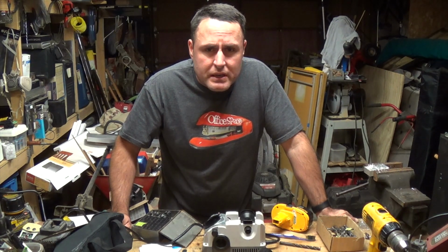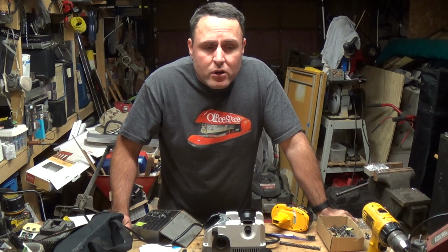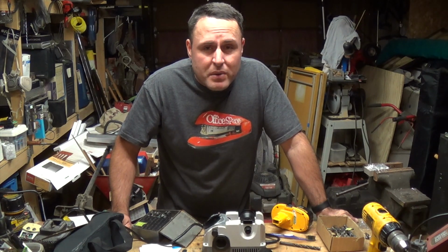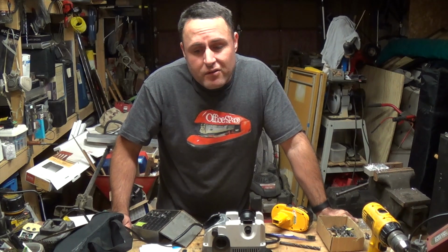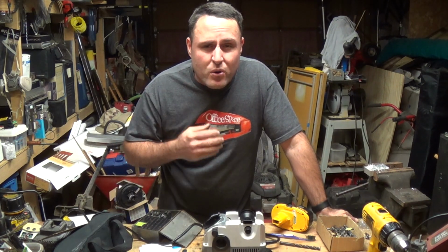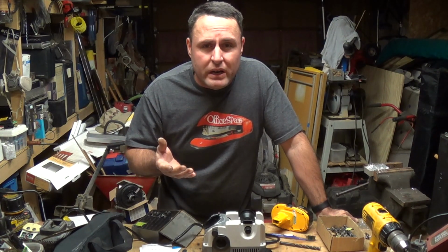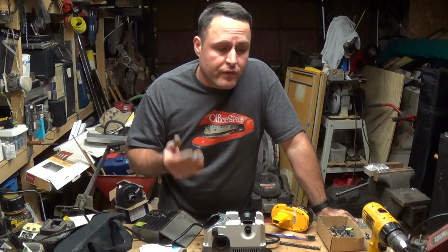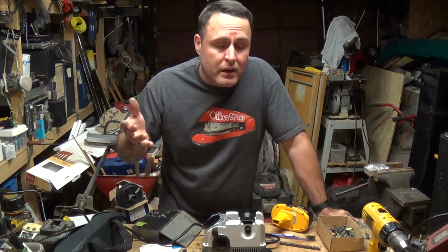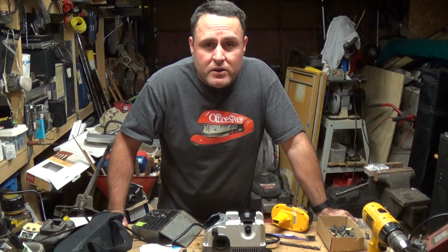Especially with the smaller drill bits, because the bigger ones, yeah, you can sharpen those by hand if you're good enough, but you could do the smaller ones that are really hard to sharpen by hand, and you don't have to keep buying those over and over again. And right there, you're going to make up your money, because you buy a drill bit. I think at my work, if I were to go through our tool account and get a smaller one, let's say a 1/8 drill bit, probably cost me somewhere around $1. Well, if I can just keep sharpening it, every time I sharpen it versus just throw it away and get another one, I'm saving myself $1. Do that 100 times, it pays for itself right there.